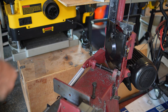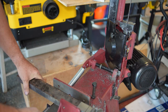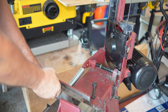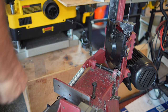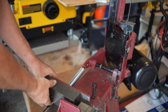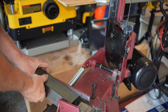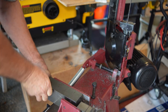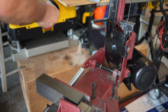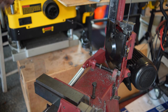The approaches you can use to fix that: you can put a piece of metal of approximately the same thickness in behind it. That means finding a piece of approximately the same thickness — or a little bit thinner. Here I'm trying to figure out if that piece works, shimming it up with another piece, and finally I can get it to clamp tight enough for a saw cut. But it's a pain and you don't want to do that over and over again. It's just too many operations to cut a simple piece of metal.